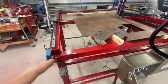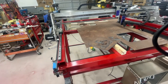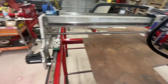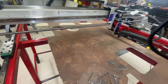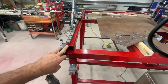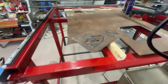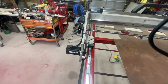I used steel for the frame but aluminum for the gantry, trying to keep the gantry as light as possible — and it still weighs a metric ton. I was amazed when I took it down to paint it how heavy it was. The frame uses two-inch square tubing, three-sixteenths thick for the main upper part, two-inch fourteen-gauge for the legs, and one-inch eleven-gauge for the cross members. The gantry uses four-inch by one-eighth-inch square tubing across, plus some thick aluminum plate I had on hand.